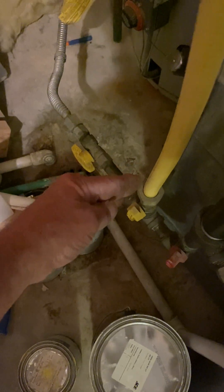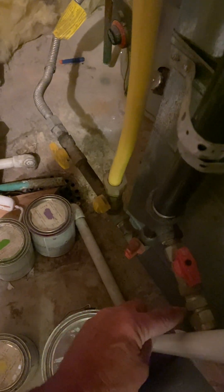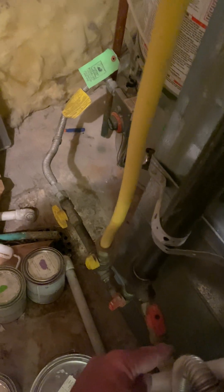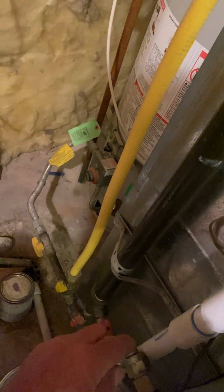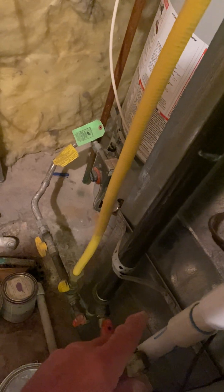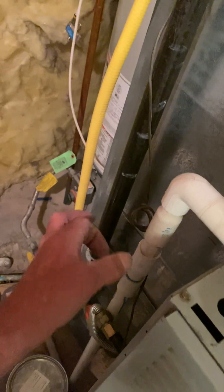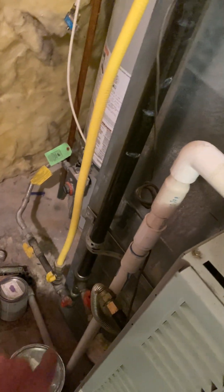From the cock — this cock is now going to be over here somewhere — you're going to add a two-inch tee with a drip leg, and I think I gave you a six-inch and flex. I also gave you a 12-inch out the furnace and a 90. With all that you can make it work.